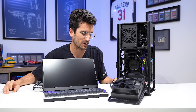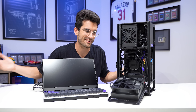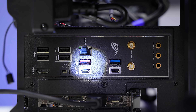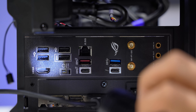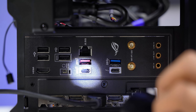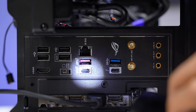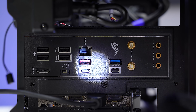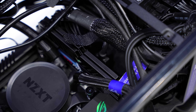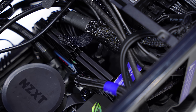Kind of at a loss at this point of what to do next. We're just going to start swapping things out one by one until something sticks. Visually, all of our USB ports look to be okay. I don't see any pins that are crisscrossed or shorted out internally. The Type-C's look to be okay. Nothing wrong with the RJ45 port. Visually, at least on the backside of the board, things look okay. Just realized I missed the front panel Type-C connector. We'll try one more time with this, although I highly doubt this is going to fix anything.